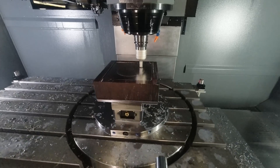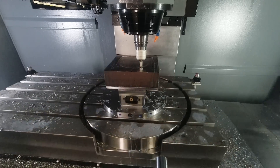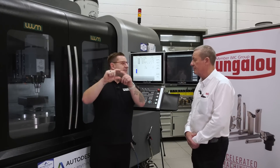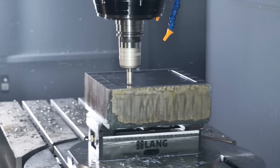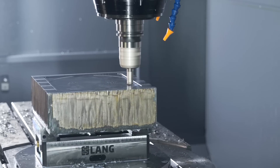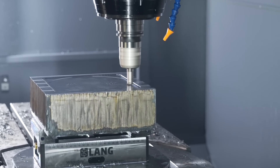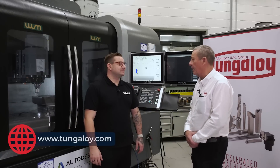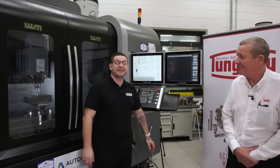If you've got a pocket that's only two or three mil deep and an end mill with 20mm flute length, you're just wearing away the bottom two mil — you've wasted an end mill. You can't get the metal removal rate you get with a high feed. Faster, cheaper, better on your machine, better on your workpiece because you take the heat out. More efficient, you do the job quicker, get it off the table quicker, make more profit. Why wouldn't you use a high feed?